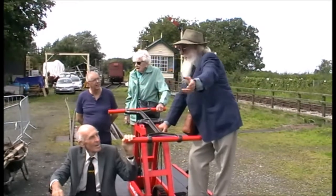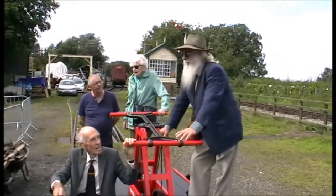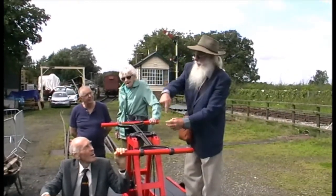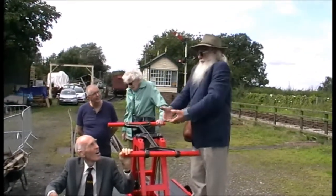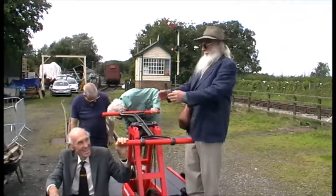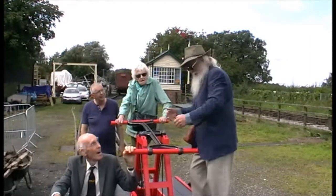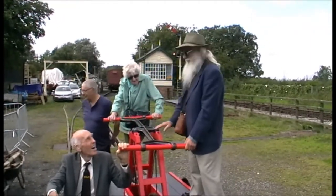So we'd go down and we'd take a few old sleepers out and put new ones in. They taught me at that age how to drag a sleeper out and then put another one in, and then drill the bolts through, and as you tighten the bolts you pick the sleeper in the chair up to the track. And then get the shovels and pack the ashes underneath, and then you get the jack out and you could get a look down the track and you'd jack it up a bit and then pack them under. And we used to do that. So these are fond memories.